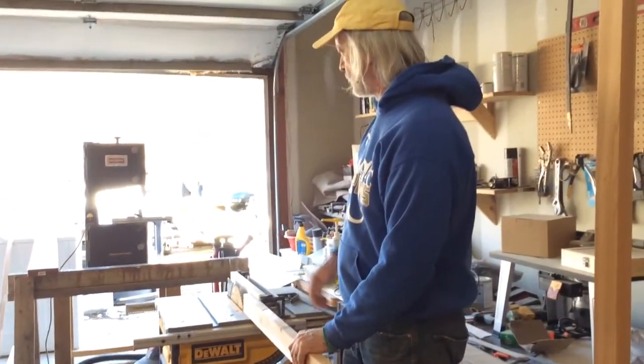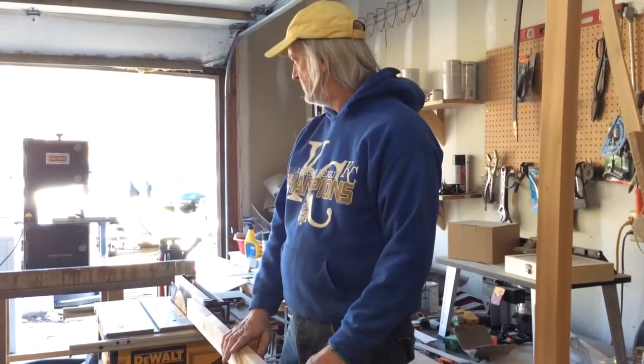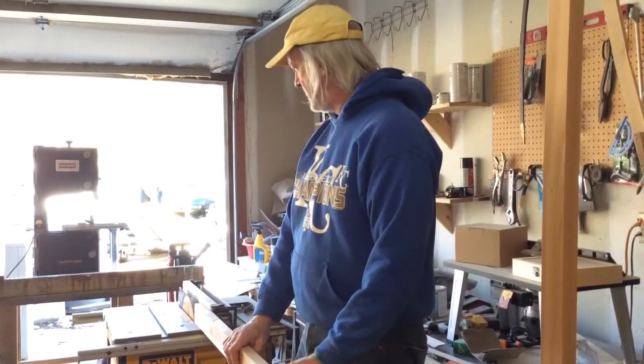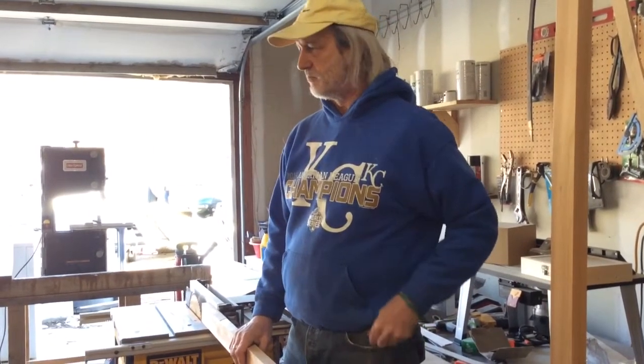I'm not sure how many strips I'm going to get out of these boards, but it's an awful lot less expensive than buying veneers. I looked online and some were as much as two dollars and fifty cents a square foot — it just seemed crazy to me. That board there was nineteen dollars at Lowe's. You've really got to hunt through the stack because a lot of pieces are full of knots and warped. But I should come out way ahead. It's going to be a little time-consuming, but I think we'll get enough decent material for a real good job. We'll do more video as we get into cold molding and start attaching these strips to the boat.